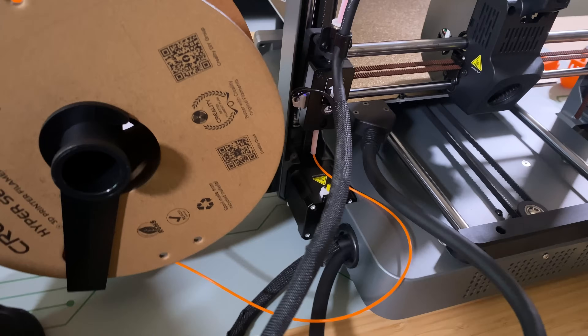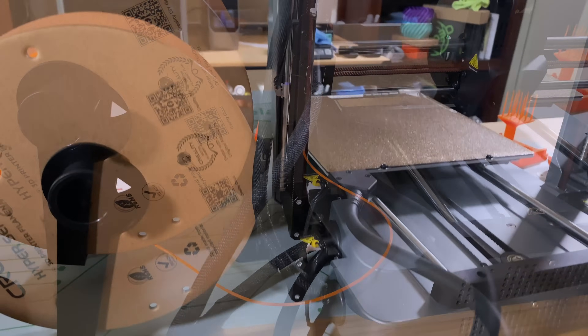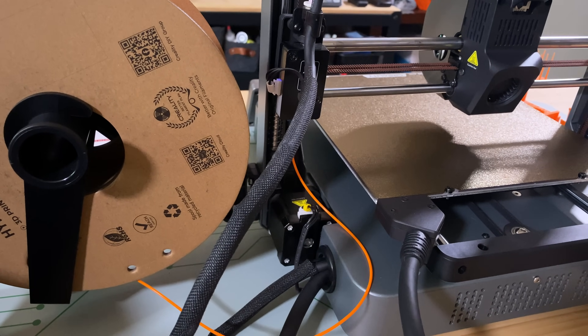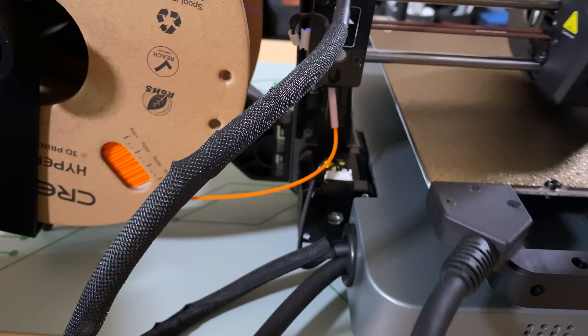Here are the things I don't like. On macOS, Creality Slicer is still kind of clunky and it flickers at random times. When printing at really high speeds, like with that 13-minute Benchy, the printer tends to rattle quite a bit. The textured PEI FlexPlate is only single-sided — it would be nice if Creality included a double-sided FlexPlate so if you accidentally destroy one side you can flip it over and keep printing. The back right corner, where all the wires enter the base, seems a little busy — not only because of the wiring, but also because that's where the filament enters the run-out sensor. When the X-axis goes to the top at the start of a print, it takes the filament along with it, and when it comes back down, the filament doesn't magically wind back onto the spool — sometimes it goes behind the stepper motor wires. So far it hasn't snagged permanently and the printer's been able to pull the filament over the motor wires eventually.